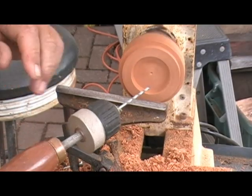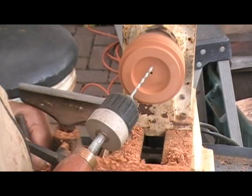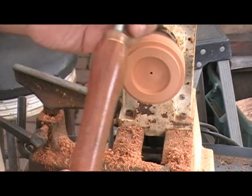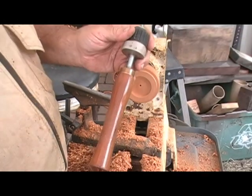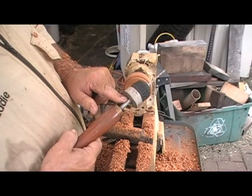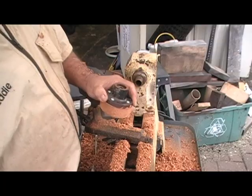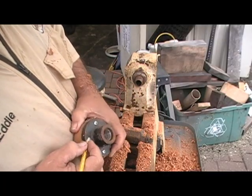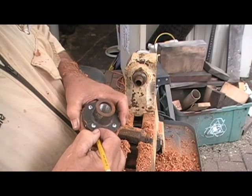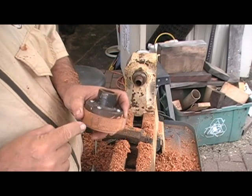This is the nine sixty-fourth bit — I need to put a hole right in the middle of the glue block and go all the way through. This will be used for registration later. Using a shop-made tool with a three-eighths twenty-four thread bolt that goes into the keyless chuck — a keyless chuck makes a great drill holder. That glue block is ready. A key item when we reuse this glue block is that the screw holes and pencil marks need to line up for registration.